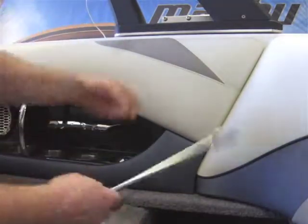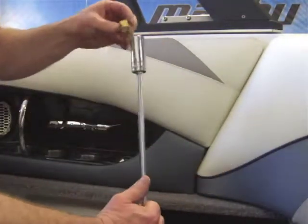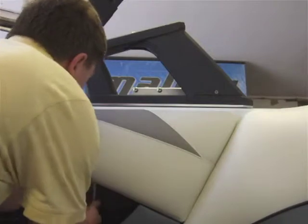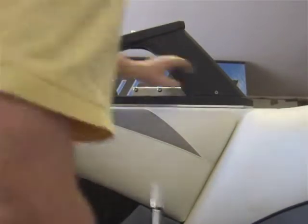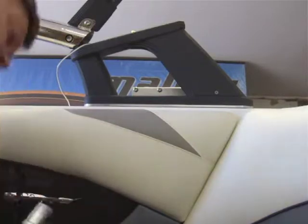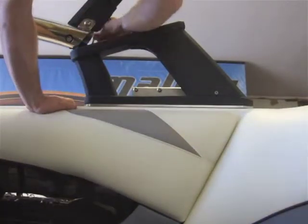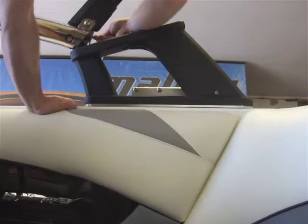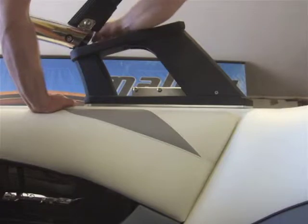As I am snugging them up, I like to double check the fit against the deck of the boat. Go ahead and feed the anchor light wire back down through the hole and pull it out into the gunnel, where you can then butt splice it back together.